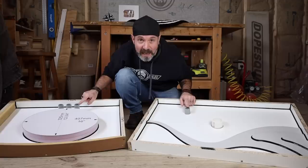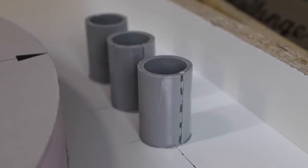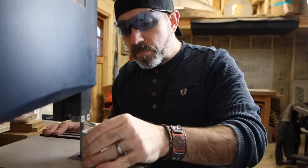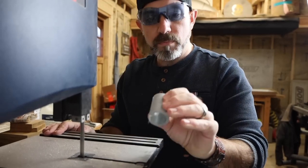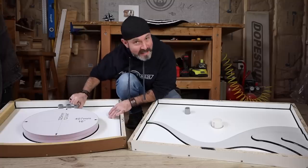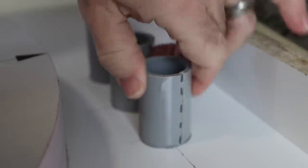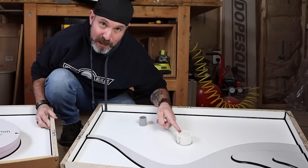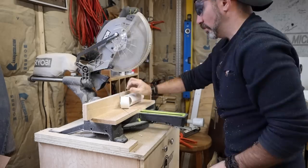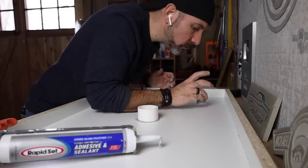As far as the knockouts are concerned, for the faucets on both molds there's an inch and a quarter PVC pipe. This time I wanted to try something new, so I cut slits in each PVC knockout. I added some tape over the slits just in case the concrete feels like seeping through. For this particular drain, it required a two and a half inch PVC knockout. I glued all of them down with a rapid set flexible construction adhesive.